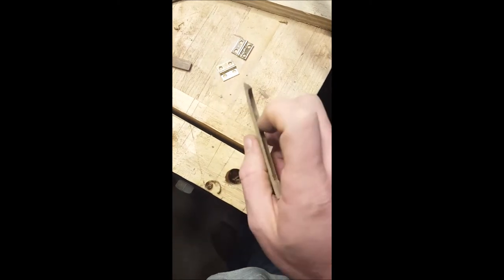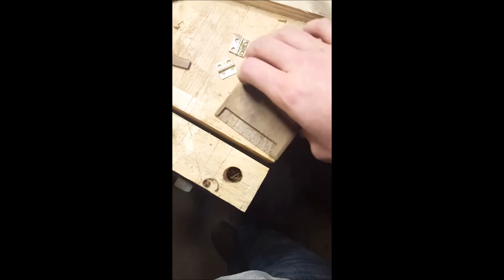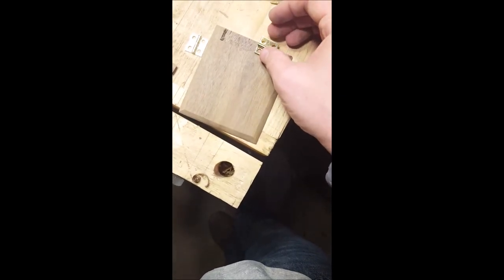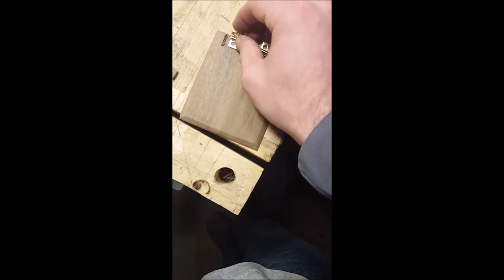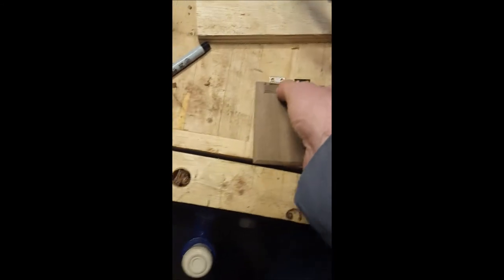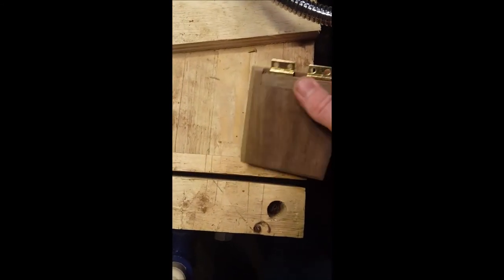I made a big mistake — I thought I was putting my hinges on but I was putting them on backwards. I carved out a spot and couldn't figure out why it wasn't working, and I ended up making it razor thin. I don't really trust the integrity of that. The only fix I could come up with was to build a little shim that's just as wide as that space, applying the hinges in the right direction and putting them flush up against their spot.